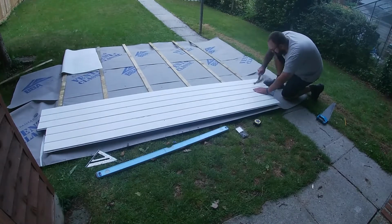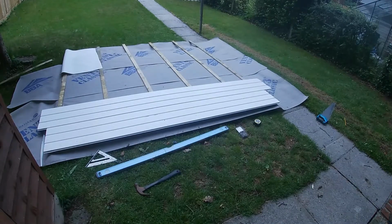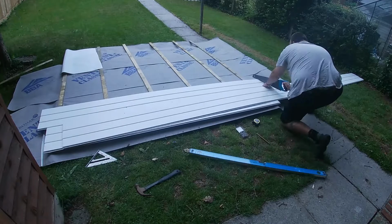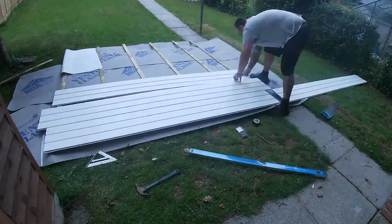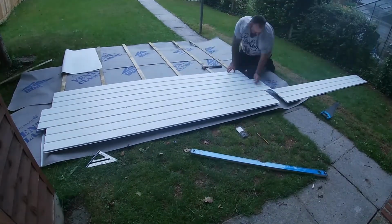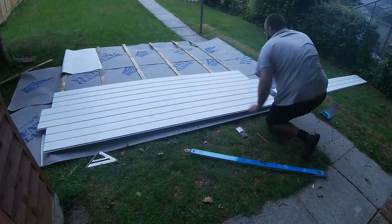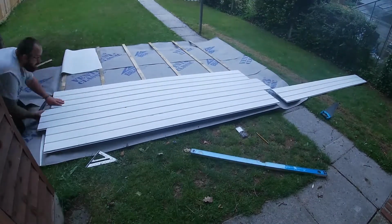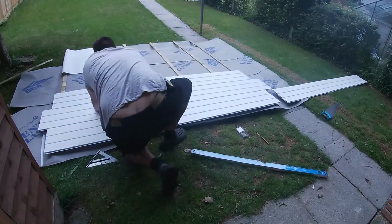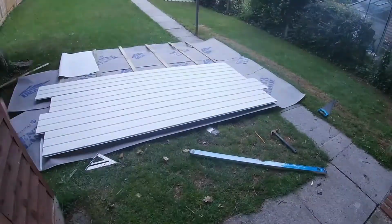I've got some fascia pins, as they call them. And here's another one. And a hand saw is the best way of cutting these. If you use a circular saw, it makes a mess. I did one with a circular saw, it makes a mess. It splits. But yes, a hand saw was it. Yeah, it didn't take long to do, really.